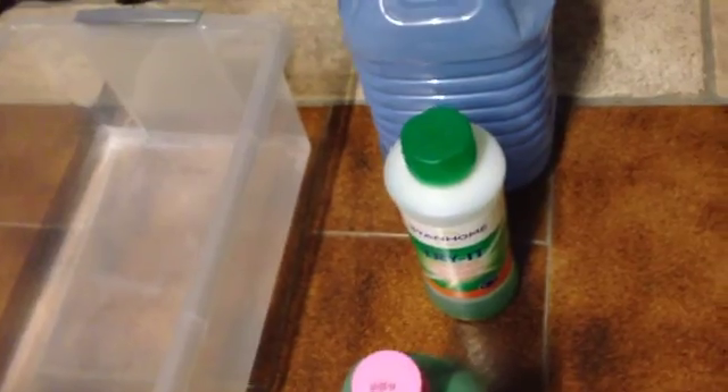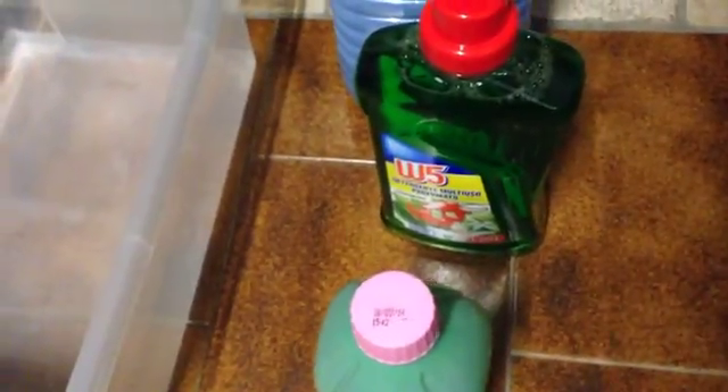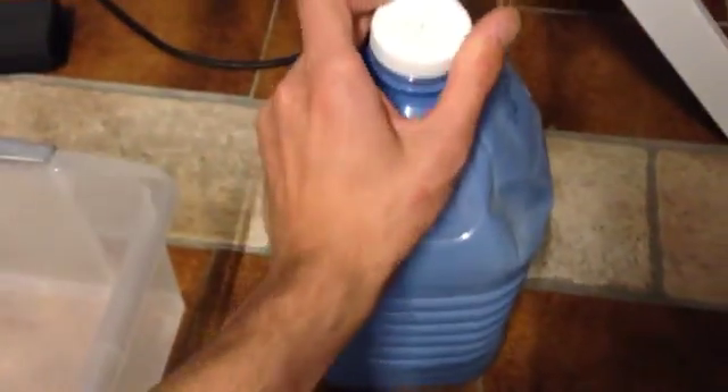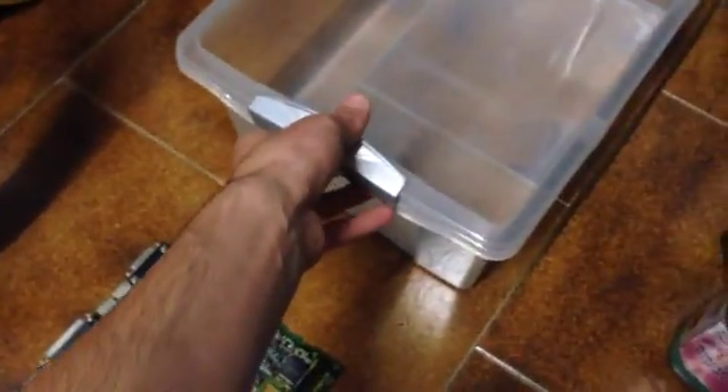This time I'm not going to use the Tri-It, but I'm going to use this detergent for cleaning, which should make the board much shinier. So let's prepare the mix. First of all, I'm going to clean the tub before putting distilled water in it, so it won't leave residue onto the board.